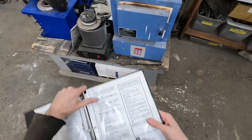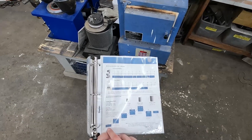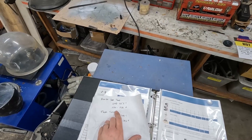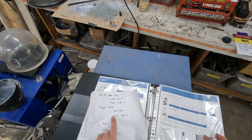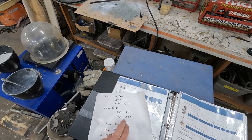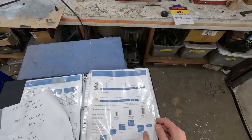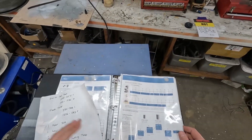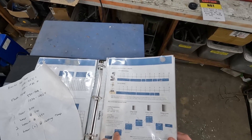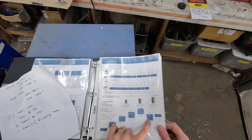The ramp holding program is right here. This cycle is not long enough, so we're going to go up to the eight-hour cycle. We look at this chart and essentially program this ramp. We have our casting temperature for the metal and the flask temperature — which you look up online depending on your metal. For the bronze I'm casting, we want to hold at 1292°F at the end, going through ramp temperatures of 300, 700, 900, 1350, and then settling at 1292°F.